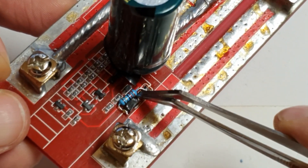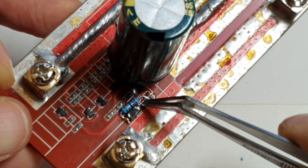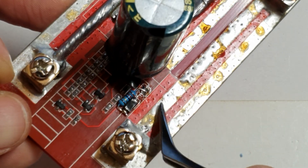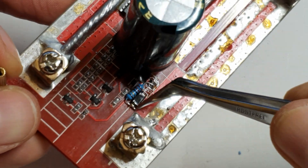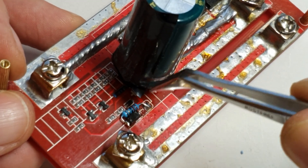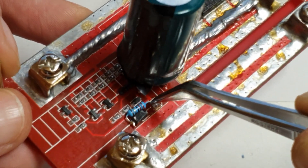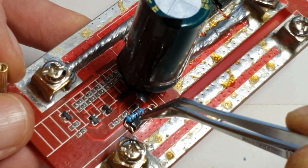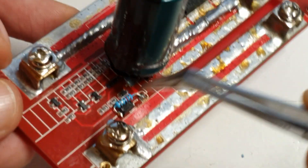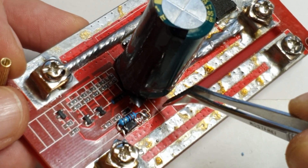So to recap: the diode is here — unsolder it, turn it around. The side that was soldered on this pad should always remain on this pad; instead of facing this way, make it face the other way. This side is now free — take a resistor: 20 ohms, 50 ohms, 100 ohms, it's really not a big deal. If you use 100 ohms it just takes more time to charge. Don't connect your battery and immediately spot-weld — leave it about 10 seconds. With a 50 ohm resistor it takes a few seconds to charge a 10,000 µF cap to 12 volts.